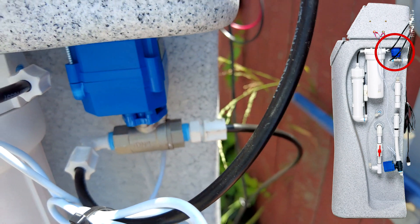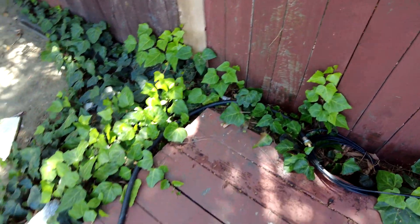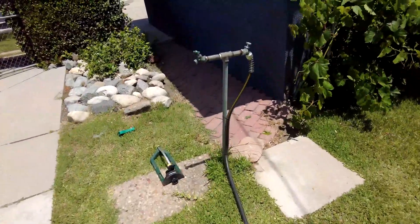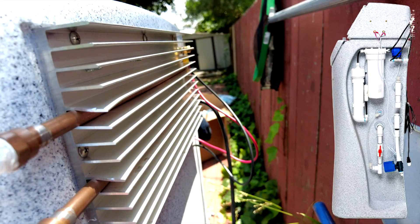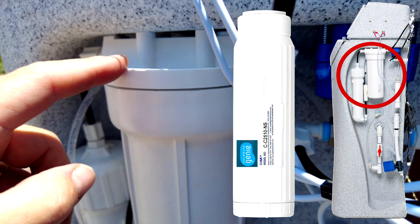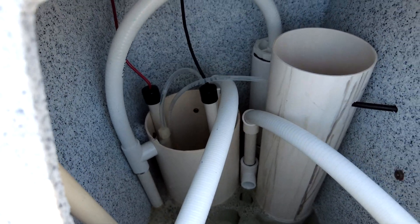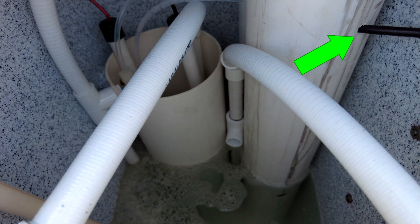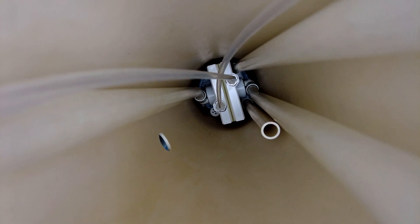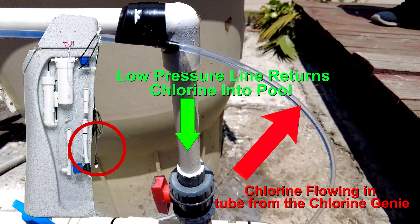On top of the Chlorine Genie is a ball valve that opens to let water flow in when the unit is active. Water comes in from your water supply — typically a garden hose in the backyard — then flows into the copper cooling tubes on the back. From there it flows into the anti-scale filter, which dissolves hardness and minerals, then into the reverse osmosis cartridge to remove more particles. Here the water is split into two streams: one is soft water that drips back into the brine tank to prevent scale from forming on the cell, keeping it much cleaner than a standard salt water generator. The other stream is untreated hard water that flows through a flow restrictor into the mixing chamber, where it absorbs the chlorine gas, and the chlorinated water is then dispensed back into the pool.